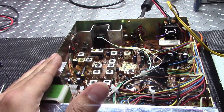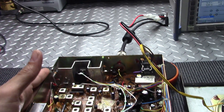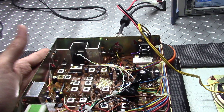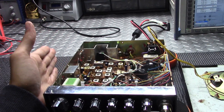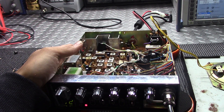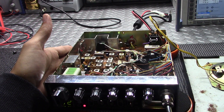If your final is blown out and you want a cheap way to replace it, these MOSFETs are cheaper than your bipolar transistors — it's a good way to do it. Otherwise, I don't suggest just ripping out a perfectly good final and throwing one of these in for the heck of it. If you go from 20 watts PEP to 30 watts PEP, you're not going to notice a difference and the other guy's not going to notice a difference either. You have to double your power just to see a half S-unit increase, and quadruple your power to go up one full S-unit.